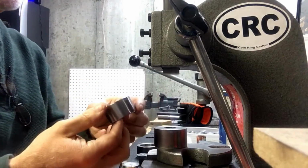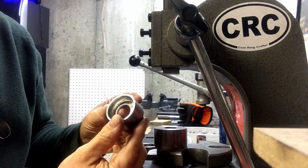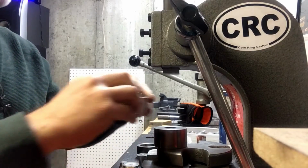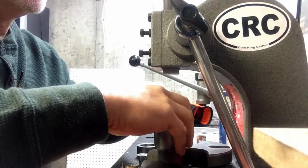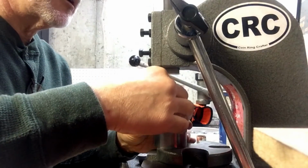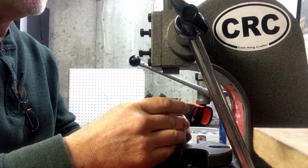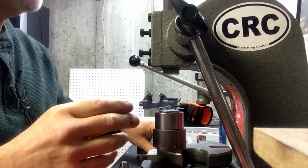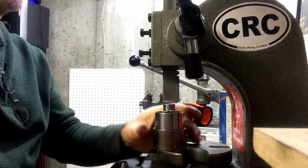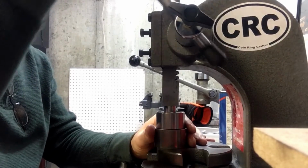And I'll take a look. See, this is a two-sided die. I don't want to push it down too far, but I still have about 1/4 of an inch of travel space to go. So I believe I should go to the bigger cone now. Yep, it fits in the hole without touching too much of the detail inside. And I will then put the spacer back on, pardon my arm, and press some more.